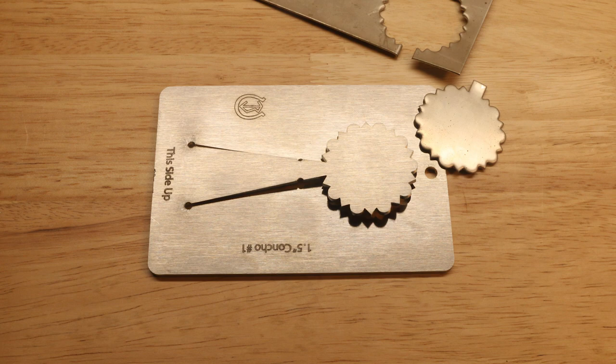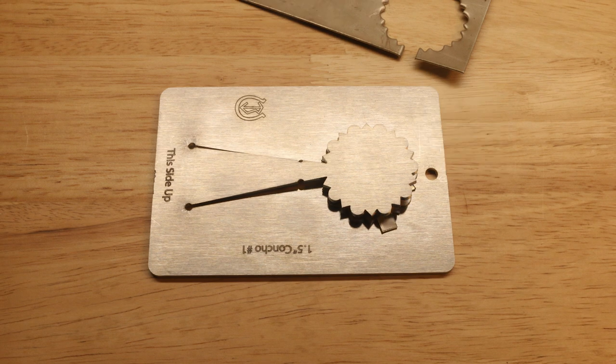Once the concho shape has been pressed out of the sheet metal, you'll notice that you have a small tab that will need to be removed. This is why the geometric perfection of the pancake die is so important. All we need to do now is to locate that tab anywhere on the concho pancake die that will allow it to be removed from the concho. So by reinserting the concho blank into the pancake die, but orienting the tab at a different location, we can easily cut it off and we don't have to do any sawing whatsoever.